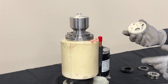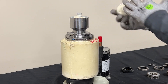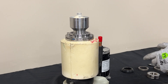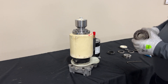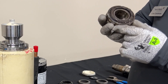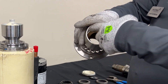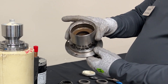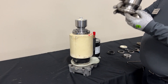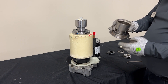Once we remove the plastic cover, you're going to be able to see the lithium grease that's installed at the factory to prevent any type of moisture from getting into the bearing. For demonstration purposes, we already have a bearing that has failed in the field. As you can see, the bearing has broken down — this is the breaker — and you can see where the bearing seized and all of the damage inside. Under warranty, the factory is going to recommend replacing the entire breaker assembly so that you're not having to tear it down.